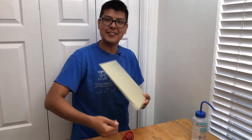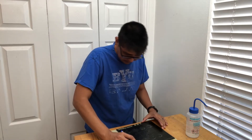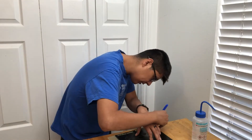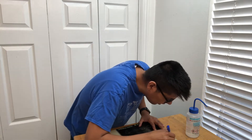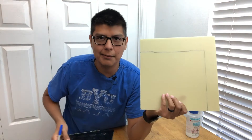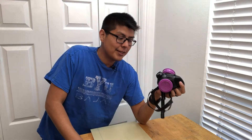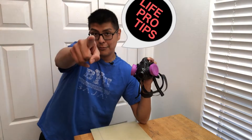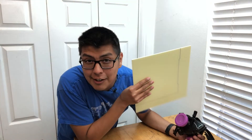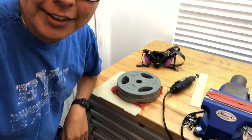The other thing I could have done is cut off that piece since this is bigger than I need. We're just going to trace the old bed — the most sophisticated way I know how. I'll try to pick the least beat-up region I can find. Sometimes you have an on day, sometimes you have an off day. I'll cut it out with a Dremel and a cutoff wheel because I am lazy. Important safety note: whenever you're cutting fiberglass, be sure to wear a respirator because the fiberglass particles will jack you up. I typically try to avoid cutting fiberglass indoors, but I did the Dremel-and-vacuum trick and I think we did that with minimal cancer.